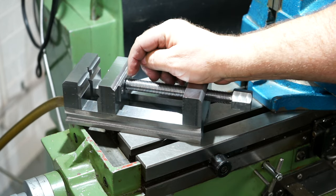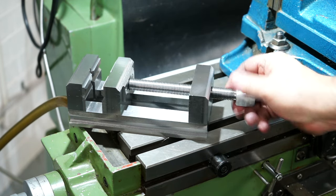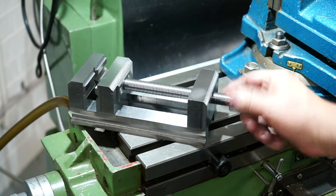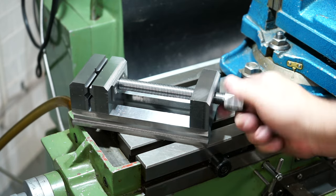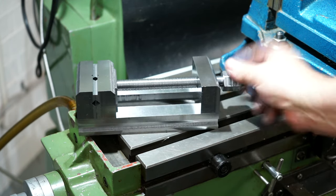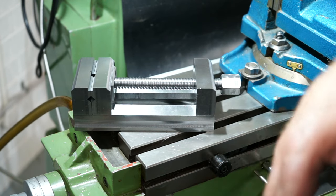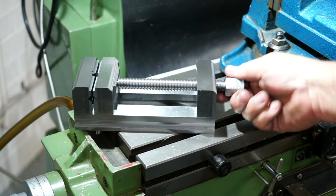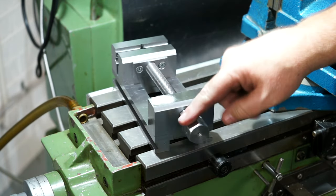Full disclosure — instead of that end piece being 10mm, it is now 9mm to make it work. I've cut a really nice thread, there's no play in it. It is a little bit tight — I probably could have just chased it one more time, but with threads you run the risk: nine times out of ten you blow it out of size if you run over it again. So I'm really happy with the thread and my little hex nut on the end there.